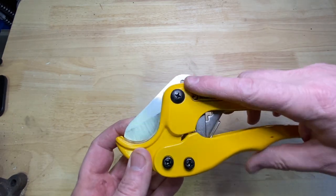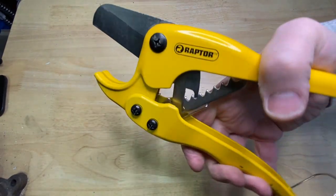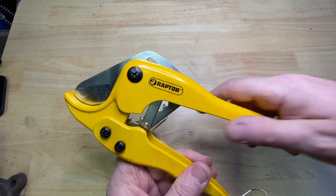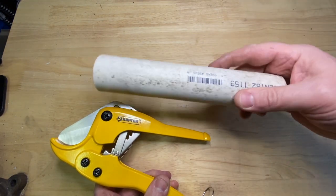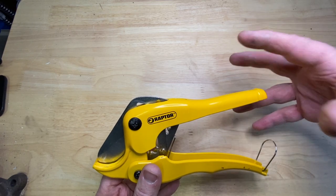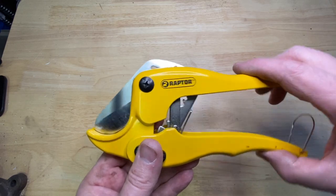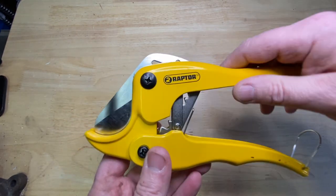It's pretty easy — you can actually get a replaceable blade. I feel like on most of them you'll be able to change the blade out. The ratcheting mechanism, the way that it ratchets, actually just helps with the force needed to make this cut. So you're able to do this single-handed for the most part. You get into bigger stuff, you might have to double hand it. If you're going to be cutting inch and a quarter PVC, you're going to maybe want to use two hands. This cuts most types of PVC, CPVC, PEX, polyethylene, and rubber hose. It's going to cut through rubber hose like butter, honestly. It cuts PVC and CPVC up to one and a quarter inch, and then PEX, poly, and most types of hose up to inch and a half. The handle has a corrosion-free finish. So far, so good — I really like this thing.